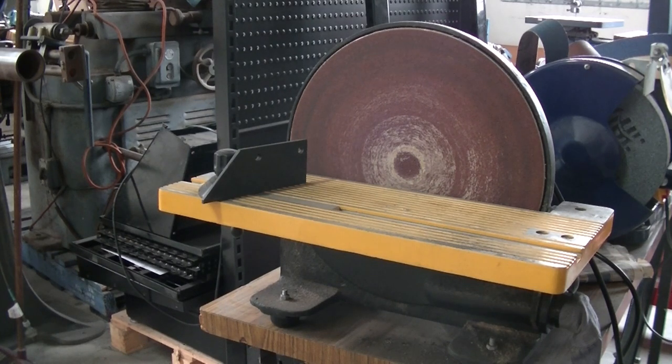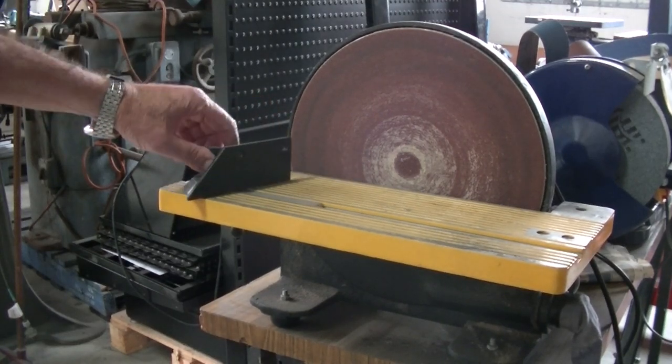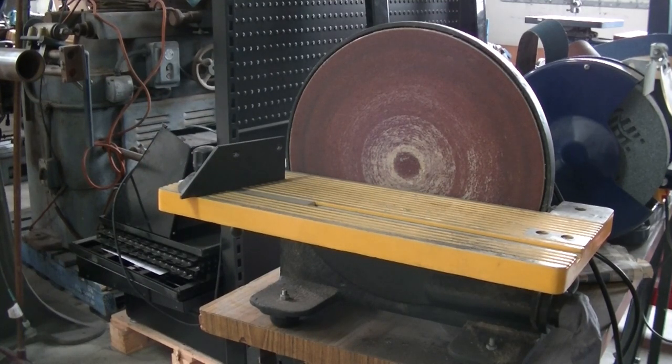Not what you'd expect to see in a tool and cutter grinder video. One big drawback: it only does half the speed you'd expect for a tool grinder. But it does have a lot of what you need — a tilting table, an angle fence, and sliding motion. With a simple tool block, it allows you to grind plane tools, turning tools, chisels, and four-facet drills very simply, and it's not very expensive — I paid under $200, and the discs last a long time.